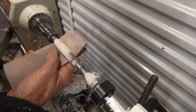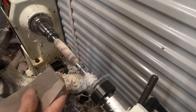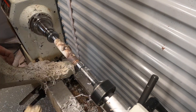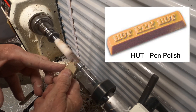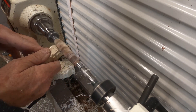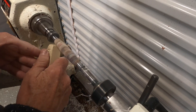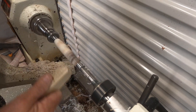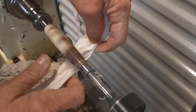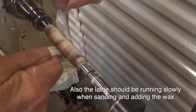I have four different grits of this micro mesh stuff and it's not labeled with numbers like most sandpapers — 220, 400, 600. It's just called ultra fine, ultra whatever, micro fine. Now I'm moving on to something called Hut. It's a pen polish but it's really hard, like a friction wax you put onto the pen itself. It gives a silky, glass-like finish. I put it on with some pressure, then wipe it off — it doesn't really have to dry. It's already so hard, you just wipe it off, keep changing positions with your paper towel, and let the lathe do the work.